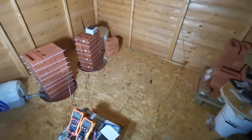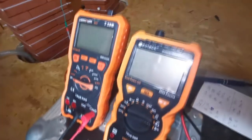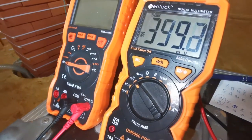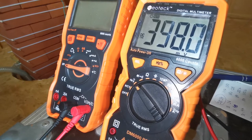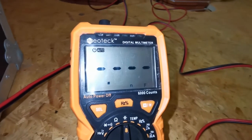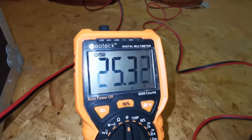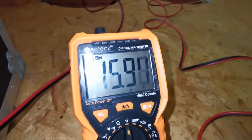In our lab testing, we could easily recreate and measure some of these electronic aspects. We measured the voltages and the intensity of currents circulating inside the test walls, and from these we calculated the electric power generated by damp walls — and the electric charge stored in walls through a battery effect. The electric charge is small, but in comparison to the weight and size of water molecules, it is significant.